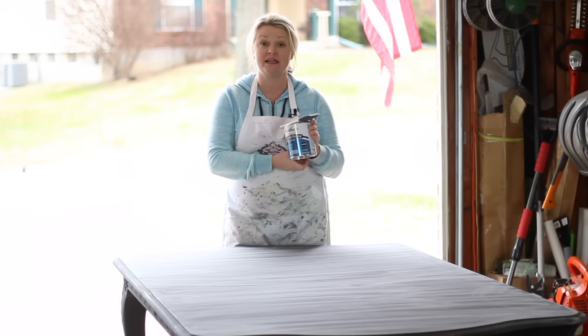I'm going to finish painting these chairs — there are a lot of them. Then I'm going to do the same type of distressing on the details just like I did on the table, to bring out all of these beautiful carvings. Remember: after you sand, before you seal, make sure you clean off all debris again. We're going to use a wax finish for all of the chairs to buff them and give them that soft, buttery feel for sealant.